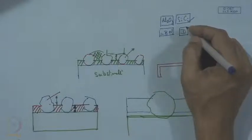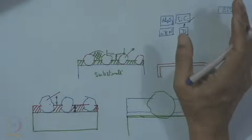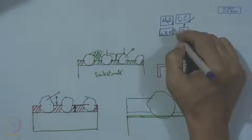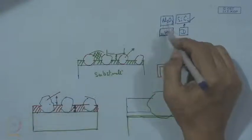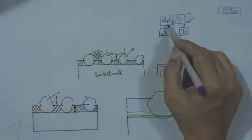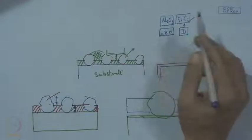Similarly, in most cases, if aluminum oxide — the conventional abrasive — is to be substituted by a super abrasive, then it becomes CBN. CBN and diamond in one layer can be equivalent to a few hundred layers of aluminum oxide or silicon carbide grains. If we consider the grinding ratio of CBN to Al₂O₃, it can be a few hundred — meaning the wear volume of aluminum oxide will be a few hundred times greater compared to the wear volume of CBN.